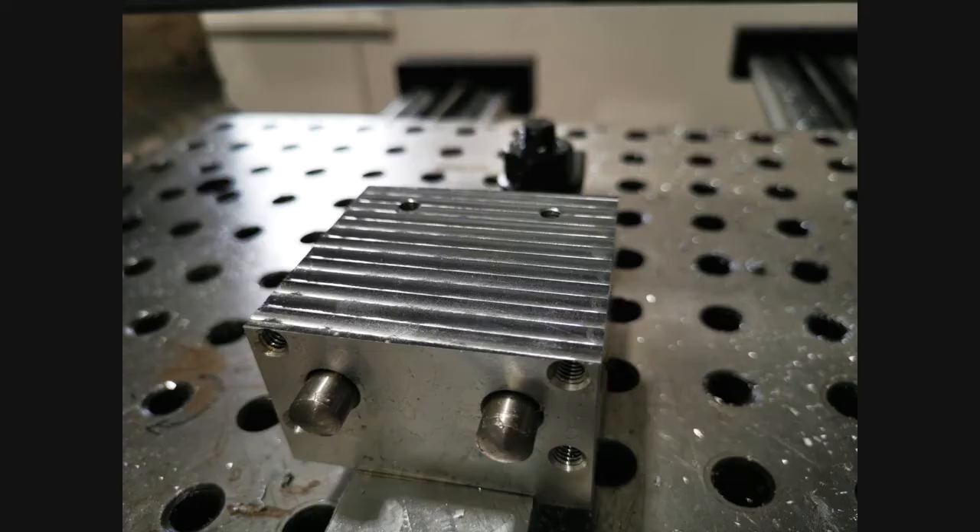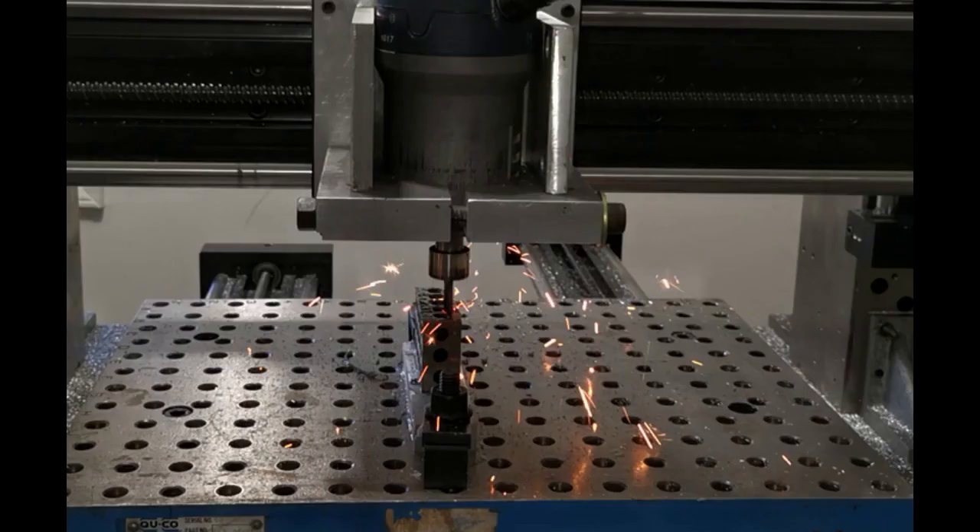From a practical point of view, there is probably quite a bit of headroom for aluminum, since I only cut at 7500 rpm, and I can get some decent sized chips if I double the rpm and double the feed rate — the chips should be the same size. But for steel, the rpm of the spindle has to be lower than for aluminum. At 3800 rpm, I have only got 0.3 horsepower left of even the fictional 2 horsepower rating.